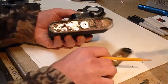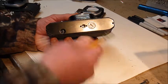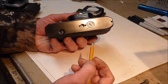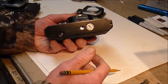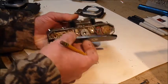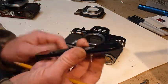The first and probably most likely part in my experience where you're going to have trouble is the battery compartment. Very often those old mercury batteries were never taken out of the camera. Whoever back in the 60s or early 70s had one of these, when they upgraded to something better or even digital cameras, they tossed these things in the closet and forgot about them, and the batteries leak. This style has a little tiny receptacle for the battery built into the bottom.